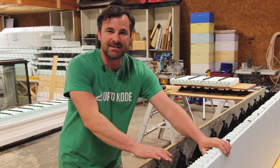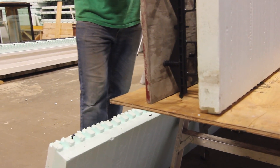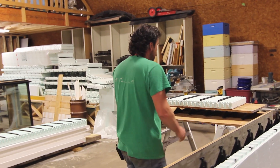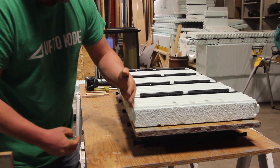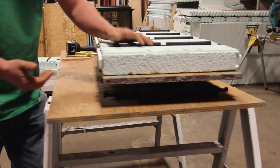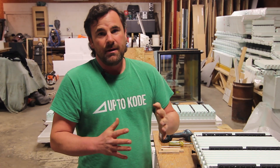Before I let you go — you might notice this isn't sitting perfectly level, and that's because the knobs are still on the bottom. Each form is 18 inches, so is the plywood. If you're up against the bottom of your footing, these knobs are going to make it out of level. You have two options: you can cut the knobs off so it sits level, or there's a second option we're going to try that might help average things out if your footings are a little bit out of level.